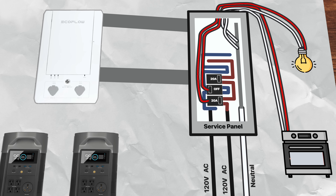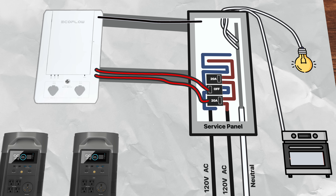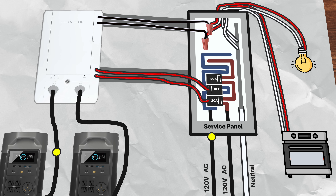Everything in your system needs to be sized correctly. For example, a 20-amp circuit breaker will trip and turn off if it detects more than 20 amps are being drawn for a period of time. This protects the wires, which also need to be sized for 20 amps, as thicker wires can carry more load without overheating. Without a circuit breaker, you'd risk running too many things and overloading the wires, possibly causing a fire. Electrical lines connect to each circuit breaker, carrying electricity to various branch circuits in your house. With the EcoFlow smart home panel, circuits aren't directly connected to the circuit breakers — instead, each circuit breaker is fed to the appropriate input line in the smart home panel wiring harness, and on the output side, the output wires run back to the service panel where they get tied into the branch circuits. By doing this, the smart home panel is now in control of either pulling from the grid or powering your electrical loads from the batteries.